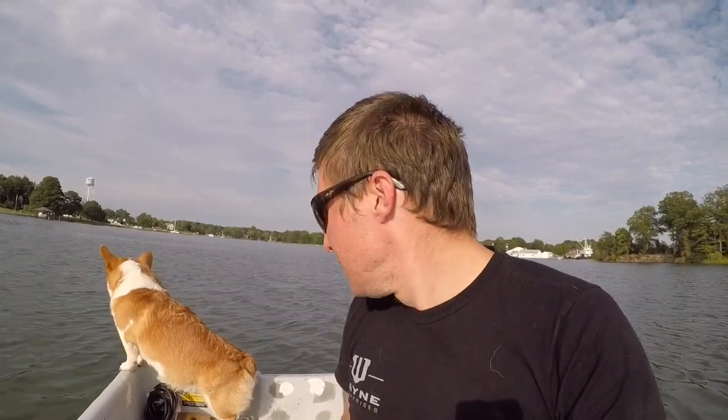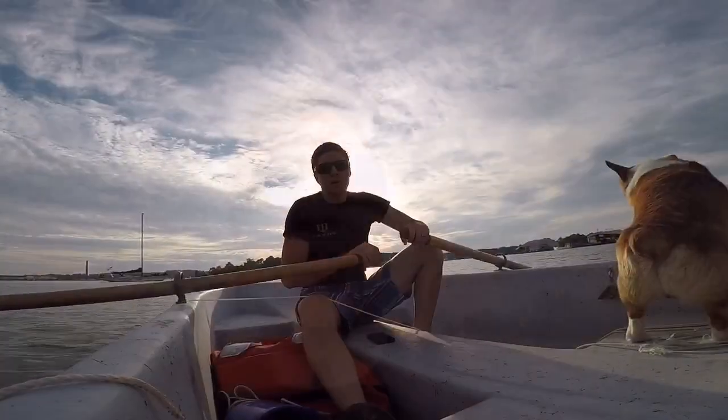The sounder's marked with knots every fathom. The most important one for us is the first fathom, because that's what we actually draw. The second fathom is because we like to have a full fathom under our keel. And from then on, I just made it out to 5 fathoms, which is about 30 feet. So let's start marking.